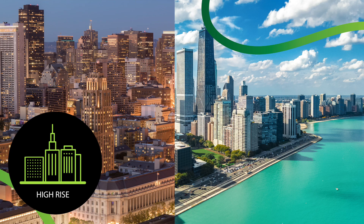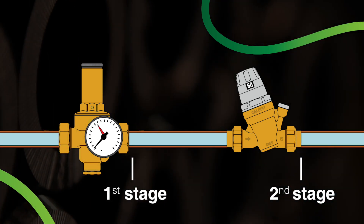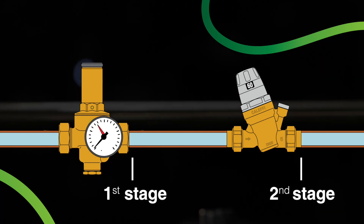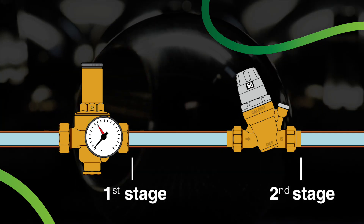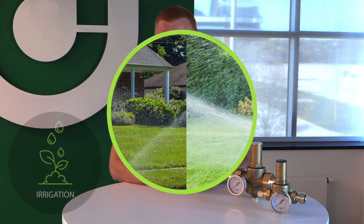As an example, let's say you have a building with an incoming pressure of 240 psi. You would use the PressCal HP with its rugged piston design to reduce from 240 psi down to 120 psi. After that, a diaphragm type PRV like our 535H can take that 120 and get you dialed right in at 60 psi. This is going to greatly reduce the potential for damaging cavitation and will lead to a much longer service life.